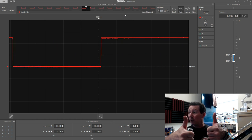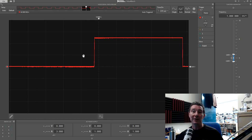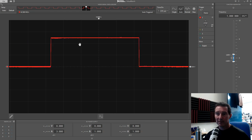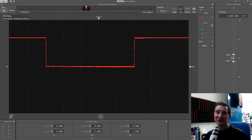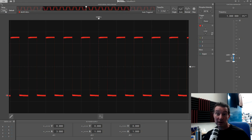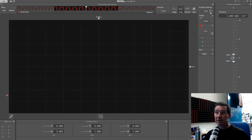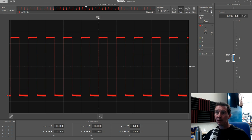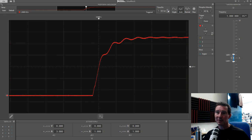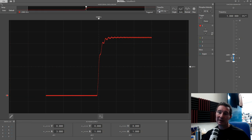The first thing I'm going to do is hit the dreaded auto button — just to see if it actually triggers on the 1kHz signal. Performing auto setup... yep, there we go — we're in! And it has variable phosphor intensity display — brilliant. Here's our time per division. As a USB scope, first glance, I don't particularly mind this. Here's the function generator over here.